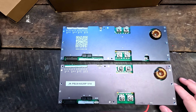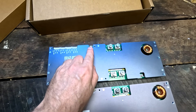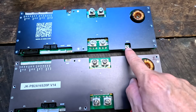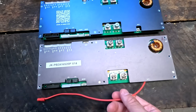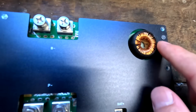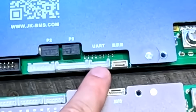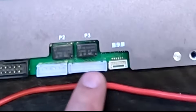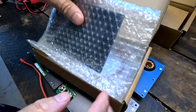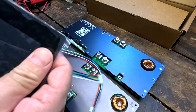Putting the old one underneath so you can compare — can you spot the difference? This port has changed to a screw terminal. This is the heating pad output negative. There's another terminal for the positive power supply of the BMS, which is no longer hardwired as it was on the old ones. There's also heat shrink around this inductor, which is interesting. But the main difference is this additional UART port, which is completely missing on the old BMS — and this is where the extra box comes in: it's a display that connects to this new special port.